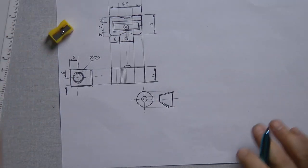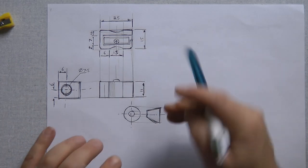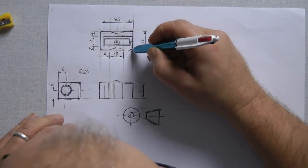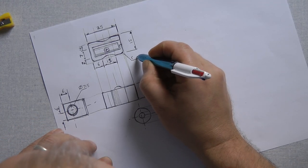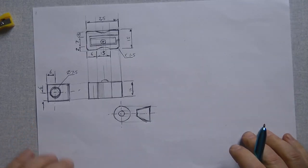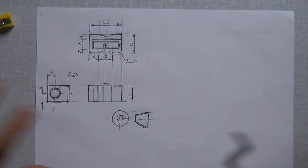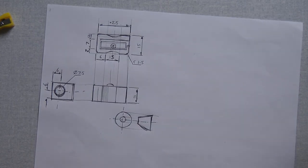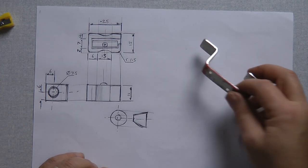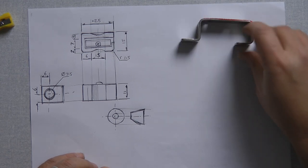This is by no means a perfect orthographic drawing. Don't colour it in — this is about communicating measurement, about someone else being able to make it. You might indicate a radius of 1.5 millimetres. Depending on your GCSE project or Key Stage 3 project, you might give more or less information, or you might do four or five different drawings — an assembly drawing or general arrangement drawing, plus component drawings. Think about your front elevation, side elevation, and plan view.